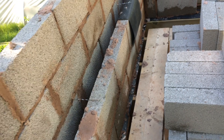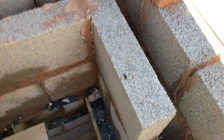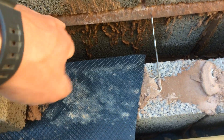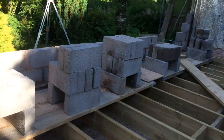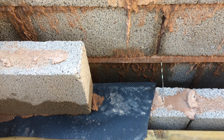Something I wasn't expecting was when the building inspector came round — you can see it in the corner here — I put in a damp proof course below the timber on the inside skin and then on the outside skin. I put one block higher because at the back of the house that's 150mm above ground level roughly, so we've had to carry that on all the way around. The building inspector seems happy with it, so that's a good thing.